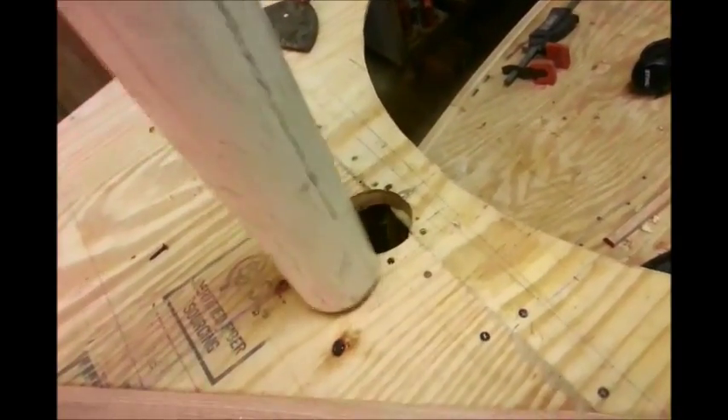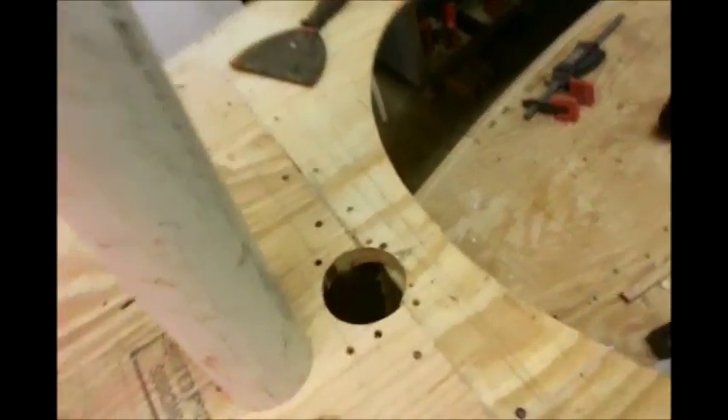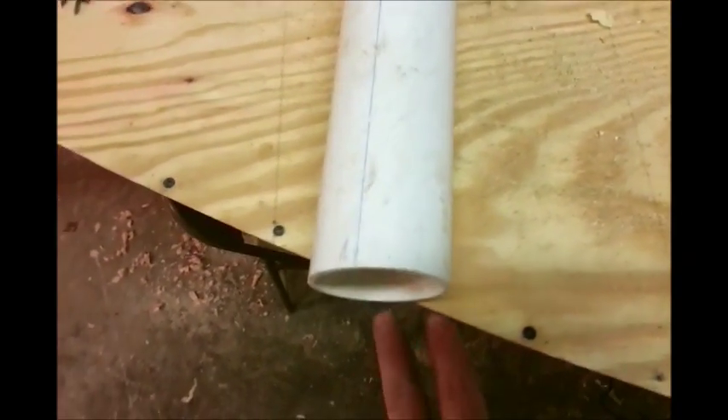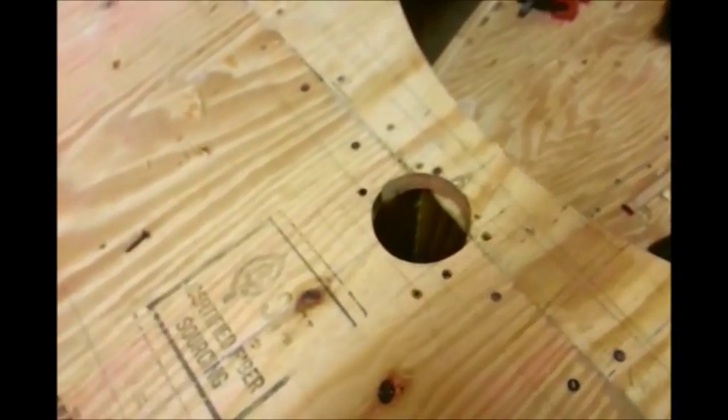We have the completed mast box in place. We won't put our sleeve in there until after we can get in there and scrape out some of that glue — we do not want that to get glued in yet. Eventually we will put a wear plate in the bottom of the hole inside the sleeve, either a piece of wood or a small piece of metal, just something so that the mast, when it sits on there and wiggles and chafes, it is not wearing a hole in the bottom of the boat. It's just wearing on this sacrificial plate.